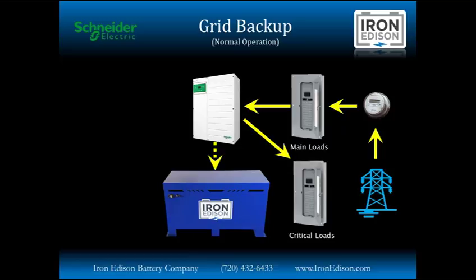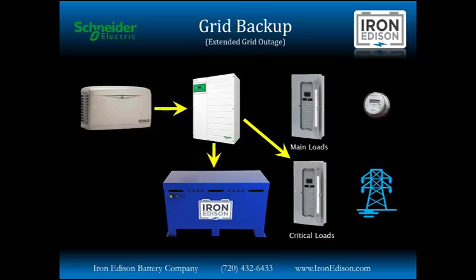So not only if we lose the grid, but if the grid power deviates outside of that window, the XW Plus will see that, instantly disconnect from the grid, and continue to power our critical loads exclusively from the battery. And this transition can typically happen in less than one cycle, or less than 1/60th of a second, which is ideal for your critical loads. Handy for data center applications, or really anytime you have very sensitive mission critical equipment that needs to be powered 24/7.